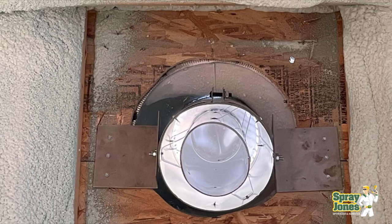So how do we avoid failure? What we found is — on one job that was frosted up — we thawed it out with a heat gun, and then rather than stuffing it with rock salt, we put closed cell foam in it. Here's why: this outer jacket stays quite cool, especially up at the roof line. The hot gases are coming up the middle at 220–230 degrees Fahrenheit, but with a laser gun we've found the outer jacket never gets much above 100–110 degrees Fahrenheit at most.